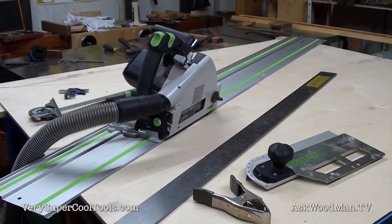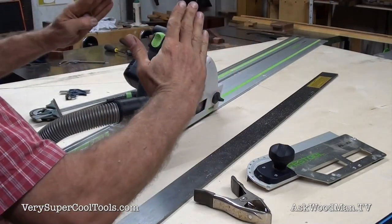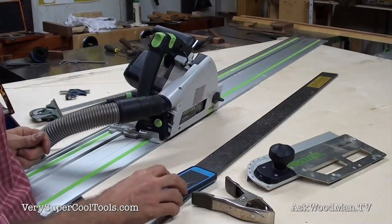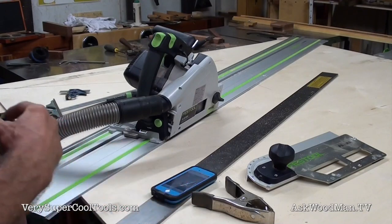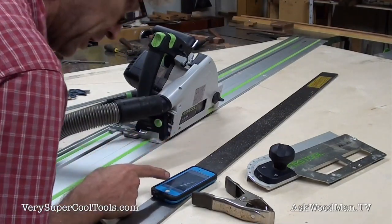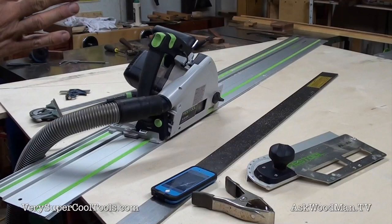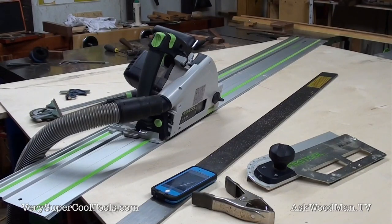This is my first trapezoid that I'm cutting out and I'm hoping it's going to be pretty close to being right. I had to go on the computer and check out a compound angle table. If you have a pyramid that's 30 degrees and you want to make butt joints, the miter complement is 63.4 degrees. I put a sliding T-bevel up against a piece of wood to try to reason this through — compound angles are always tricky for me.